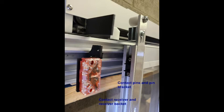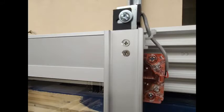This video will show you how to mount and adjust the gate switch on a good gate. During the video, you will see that there are two types of switch brackets. The first, shown here, is for manual gates. It has a single magnet at the top and a raised strike plate for the magnet to attach to.